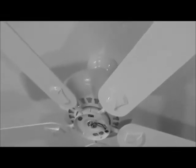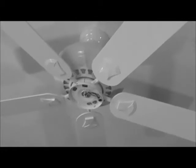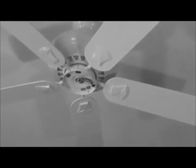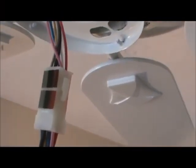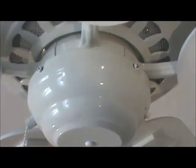We've got all of our fan blades attached to our fan. The last step is to put on that cover plate on the bottom, which you could attach a light kit to — but we'll have a different video on attaching a light kit. This is just going to finish off our fan. You can see right where it snaps together — that's from the fan to the housing. Here's the housing for our light kit or our bottom cover that has our switch. These are all the control wires right here; they snap together — notice the colors all line up, and they really only snap together one way. We've got our bottom plate up, and the last step is to put on our pull chain.